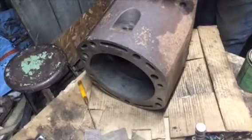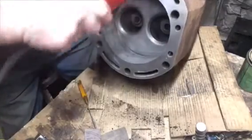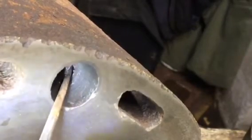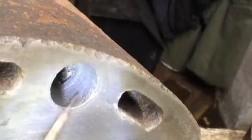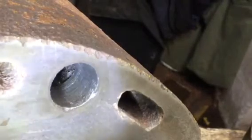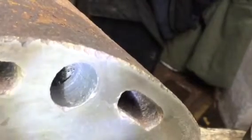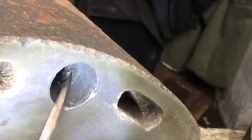Cleaning the holes for the cylinder studs. On these holes for the cylinder head studs, you see the first three-quarters of an inch or so are drilled, and then the holes get bigger and the rest of the hole is as it was cast. Keep this part in mind because I'm going to be making some pilots for later on when I just set the heads in place before I bolt them down — so that it lines the heads up for when I work on the exhaust manifold.